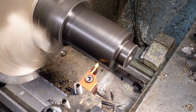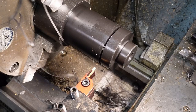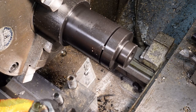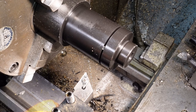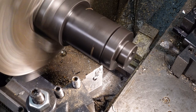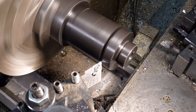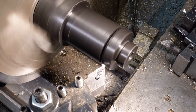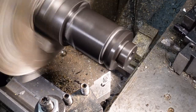There's a taper on the section with the mounting ears, and the angle's just over 28 degrees, so I'll use the compound slide to cut that taper. This Delrin is nasty stringy stuff, but at least the chips aren't sharp. I'm using a narrow diamond-shaped insert — I think it's a DCGT 11T308. I'm cutting the taper in smallish bites so that I don't get any digging in. Softly softly is the watchword. Those chips are stringy.